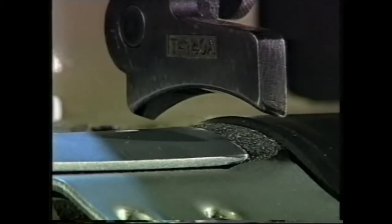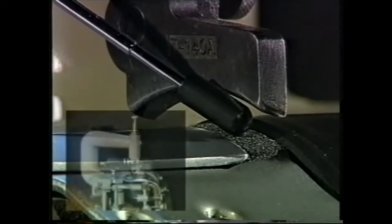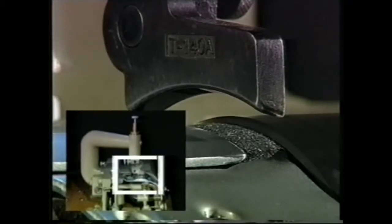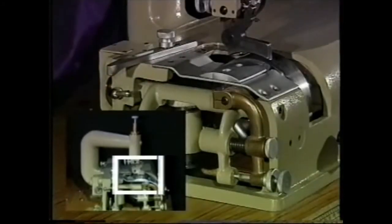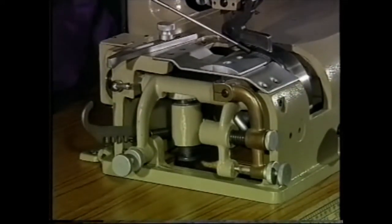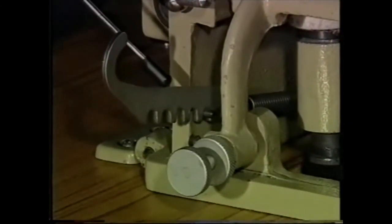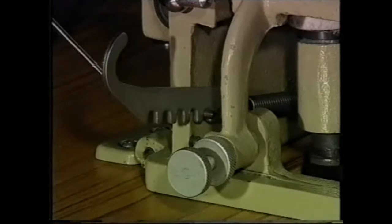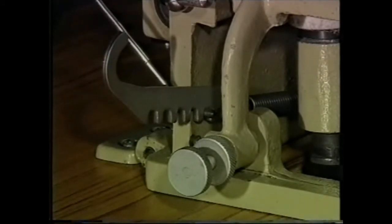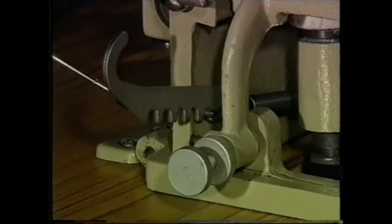The main parts of the machine include the feed roller, which feeds the work onto the machine. This is held under tension by a spring and a hook. The tension can be varied by adjusting the slots. The softer the material to be skived, the lighter the tension.